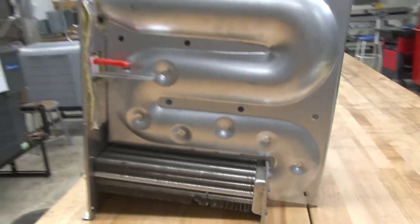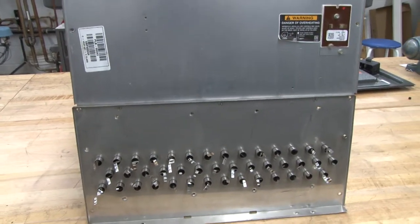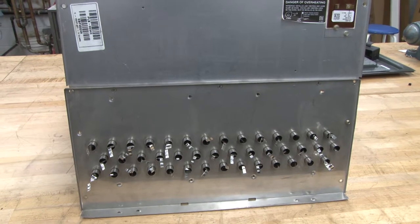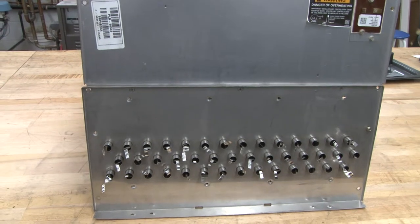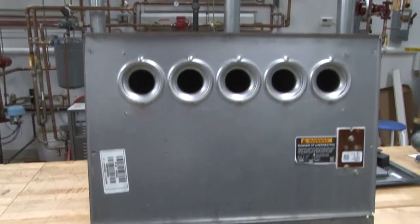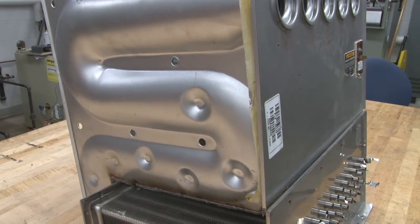This system is designed to remove at least 90% of the heat energy from the flue gases. These furnaces can get up to about 95% to 97% efficiency, putting only about 3% to 5% of heat into the chimney outdoors — compared to a normal furnace at about 80% efficiency, which sends 20% of the heat energy outdoors. Years ago, some furnaces were only 50% to 60% efficient, and a great deal of energy was lost. This is the new technology, the new type of heat exchanger designed to control heat loss from a furnace.